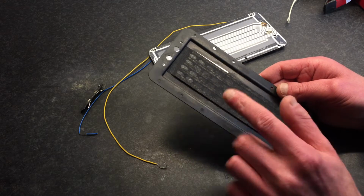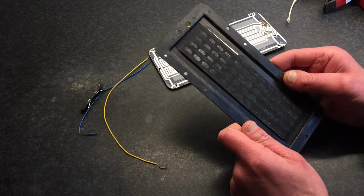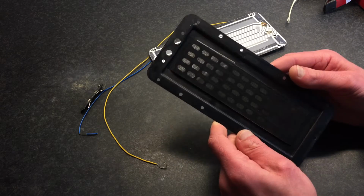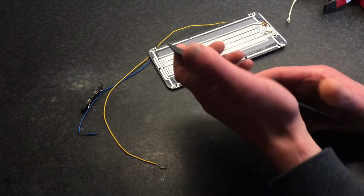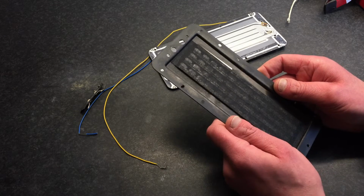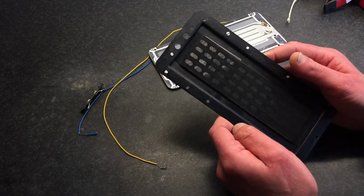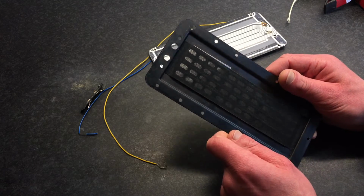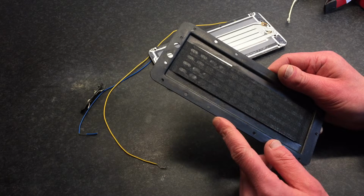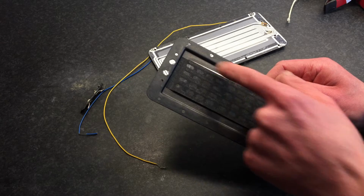The magnets, very nice magnets. This is another surprise for me. I really thought they used thicker magnets. I even thought they might be using 3mm magnets, but actually, that's where having one in your hand is really nice. On pictures it looks different, and you're biased as to what you expect as well. But these magnets are 1.5mm thick. Might be slightly off, that they use some sort of imperial sizes, that could be, but so 1.5, 5mm wide and 50mm long.